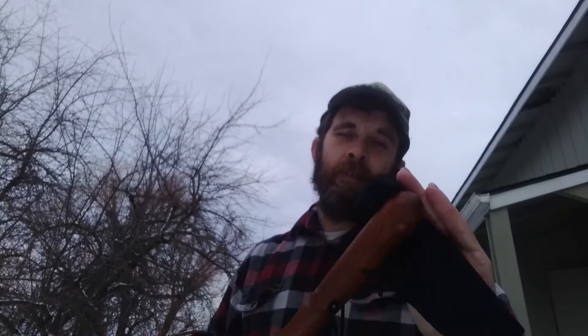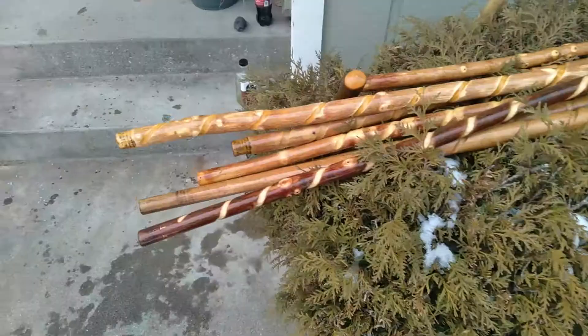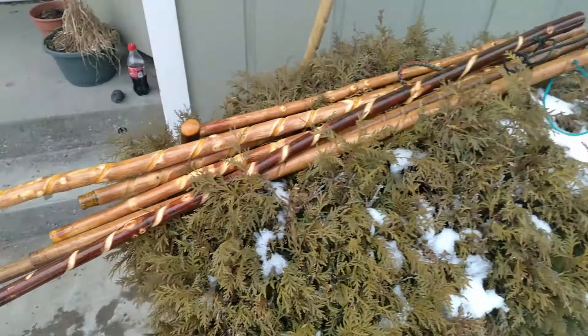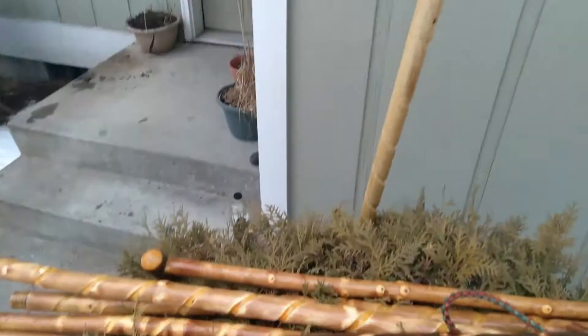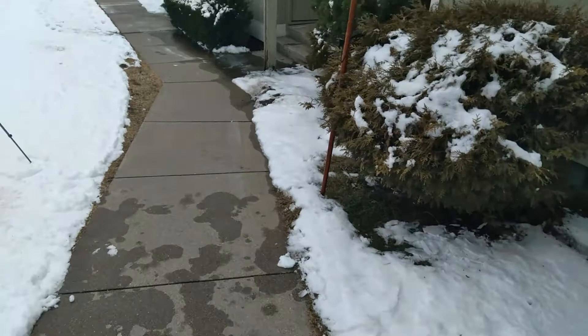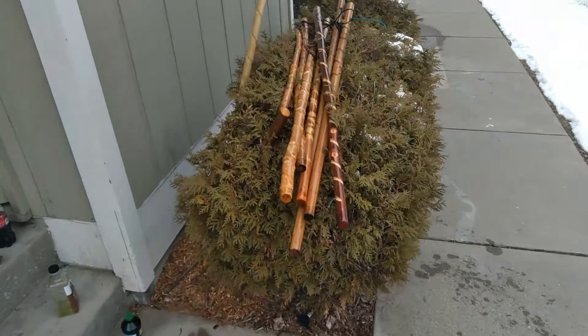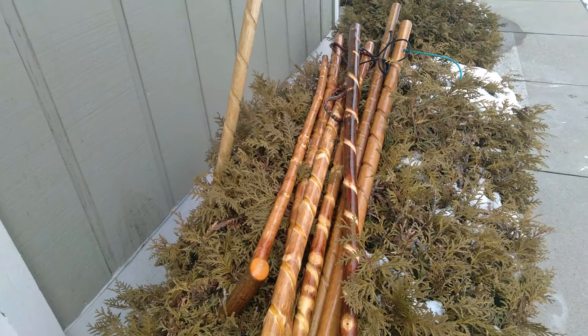I'm going to do a slight wipe back — I don't want to do it really hard. Now the linseed oil one. I'll come back to each of them after I've wiped them all back. They are all oiled up. This one's just absorbing and sucking up the oil. Hit it with oil, wipe it back, and leave a thin layer — that's how you do it.